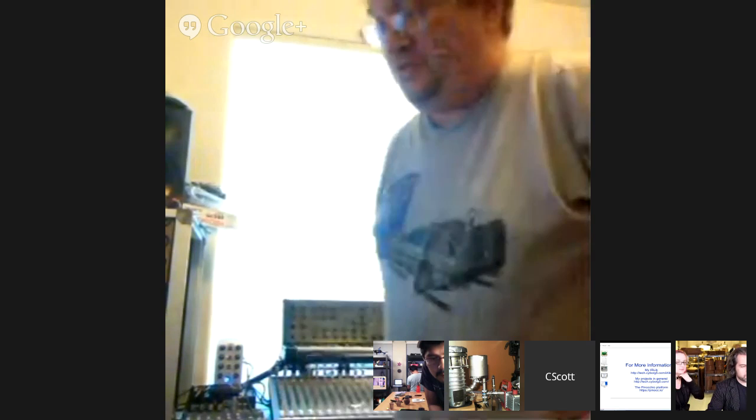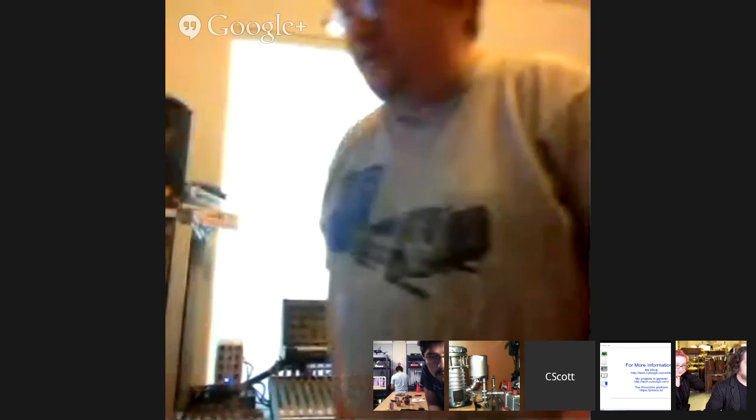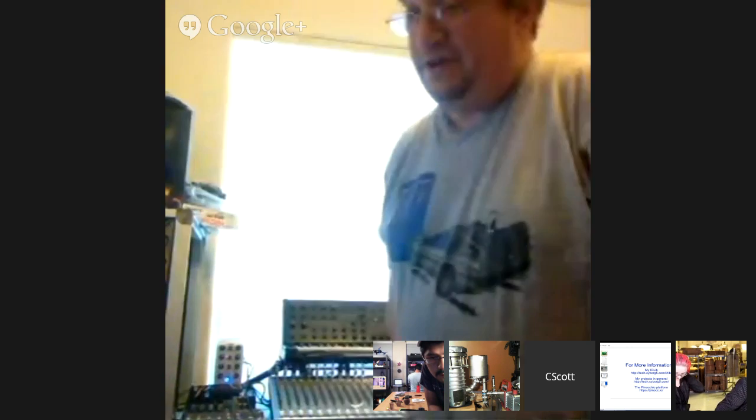That's a nice synth. So who made this synth originally? This is a Yamaha CS15. It uses a volts per decade voltage control scheme. It's not volts per octave. The trick there is, a linear DAC doesn't do exponential outputs very well because you lose resolution as you drop octaves. So the trick is you just use a 2-channel DAC. You set one DAC channel to do octaves, and you do one to do intervals. Therefore, you only need 12 codes out of 96 for your interval, and that's accurate enough that you can do microtonal tunings. I haven't done it yet, but I can do Pythagorean or whole number harmonic ratios. You name it. Right now it's just set for equally tempered. Since I'm only using a fraction of the DAC's capability, that's also why I could extend the octaves downward. I'm only using 6 codes for octaves out of 12 bits. So no matter how crappy the DAC may be, you'll find a good linear function out of it.